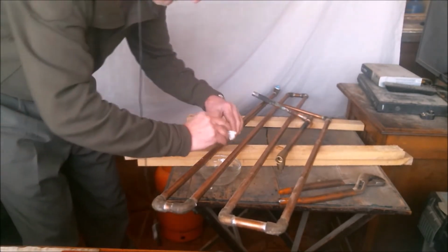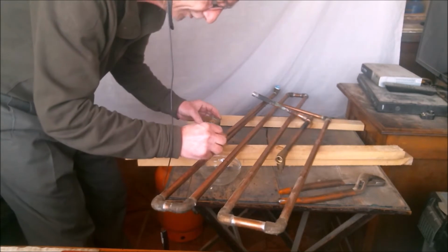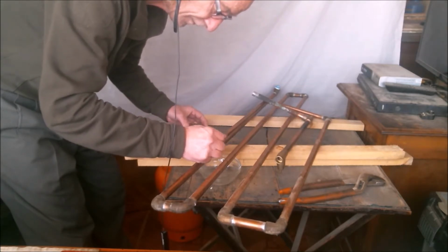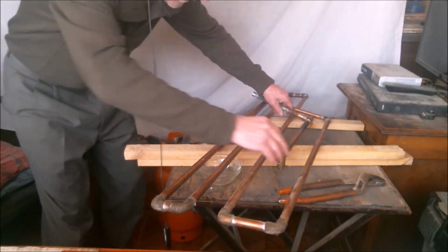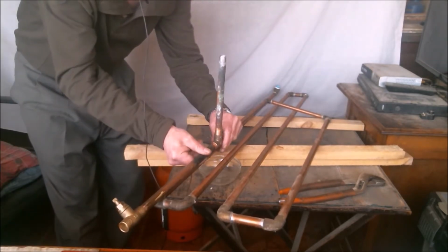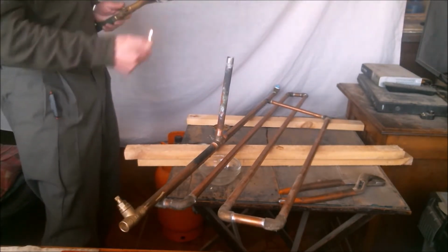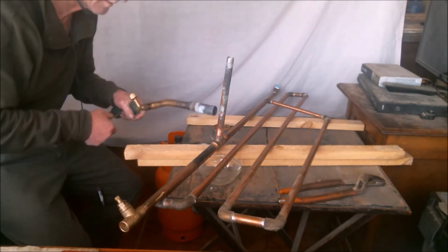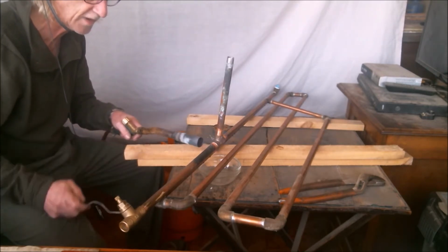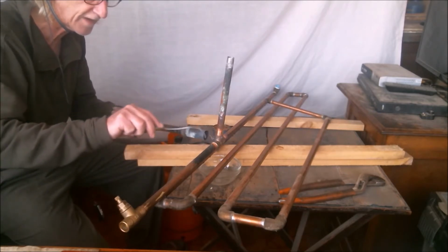We clean any dough residues, clean again, and apply flux again wherever it has been touched by dough. We join the new tubing in the right position. We must heat all the fitting with a torch, a uniform temperature so we can get the solder in all joints. We put solder here, here and there.